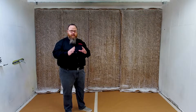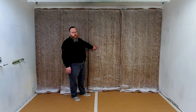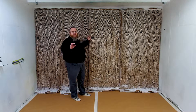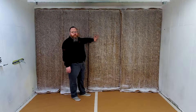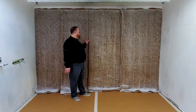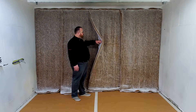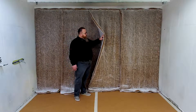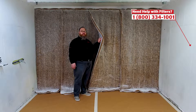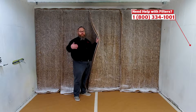We are going to do a dedicated video on the W Series, but you'll notice some differences here. You've never seen a white face on a paper filter before. RP has always been brown paper, but the W Series has a white front face layer instead, which lightens up your booth a little bit. This particular filter — the high capacity ultra efficiency Series 5200 — also has a thick polyester on the back as a final capture layer for finer materials. It uses a virgin polyester versus the reclaimed polyester on traditional RP filters.